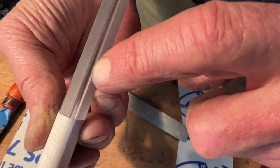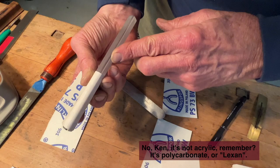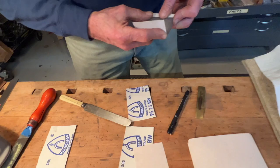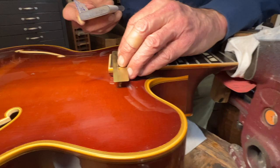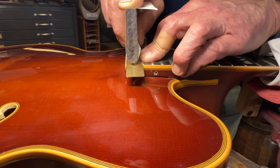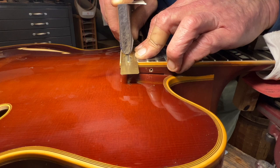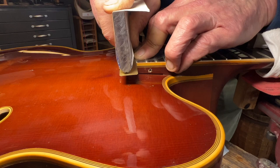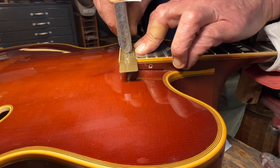You can see that there's a half round groove in this piece of — I guess it's acrylic, clear acrylic plastic. And it's relieved by these cuts so that we can polish just the top of the fret. We'll use the brass mask. Because of the shape and hardness of the plastic, it's going to transfer through the sandpaper the correct shape to the top of the fret, blending those facets that we cut with a file.